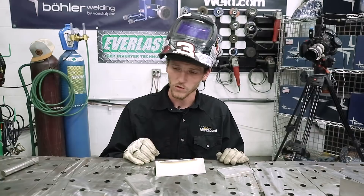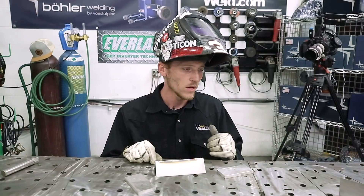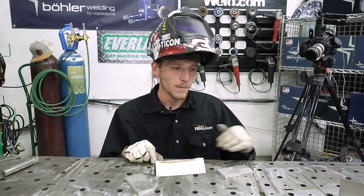This takes a lot of control — not just with the arc, but with your wire. You don't want to use too big of wire because then you're trying to melt the wire rather than your base material. Let's get over to that piece and make another weld.